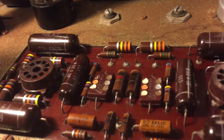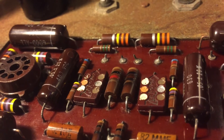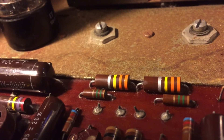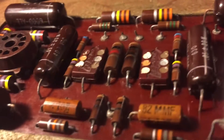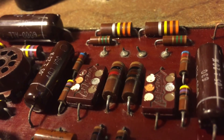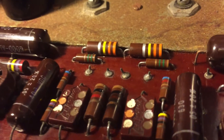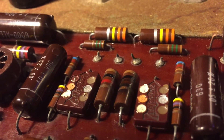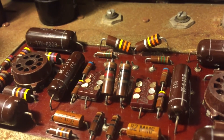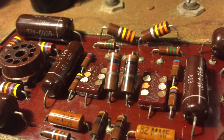The resistors in the middle — I'm seeing some burning on them after they were cleaned, and that leads me to believe they should probably be tested again, as well as the ones on the end which can't seem to be tested in circuit. I'm going to pull out one side of each of these resistors and test them again. Based on what I'm looking at, I may just replace these even if they test good, because the heat damage I'm seeing on the outside of the resistor bothers me. I've lifted the resistors I want to test out of circuit — now I can get a correct reading on them.